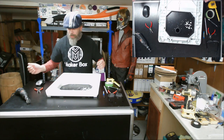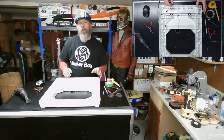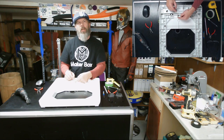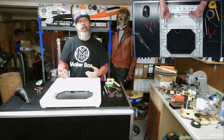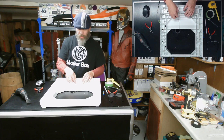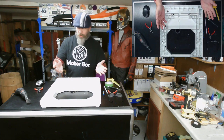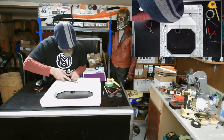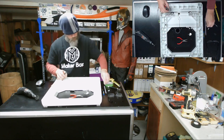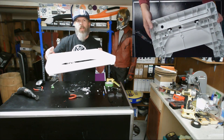Now we get a straight shot at the back of that switch. The other thing we're going to do: if you remember when we unplugged our Z-axis motor, the wire went down through here and popped back up on this side to plug in, and there was really no way to get this bottom off without accidentally unplugging the Z-axis. So I'm going to cut out a section right here so when we put it together we can leave the Z-axis plugged in and the wire just lays through that opening.